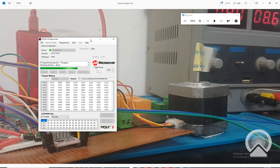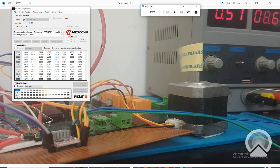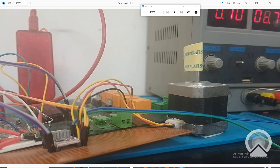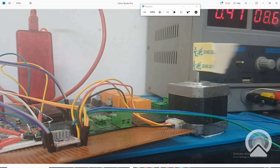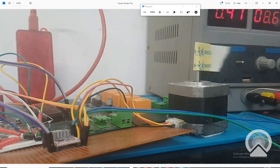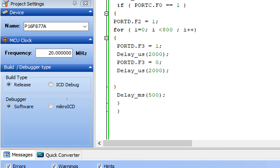The hardware is starting because it's being programmed and the supply is on. Programming is done. Power it up from the PICkit 3 programmer tool. Now this is the button - I press it and the motor starts, then after four rounds it stops. This is exactly what we wanted: the motor completes four rounds and stops only when the button is pressed.